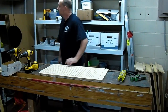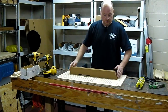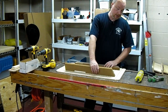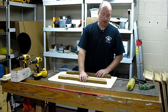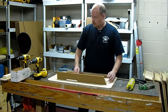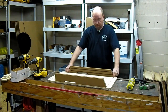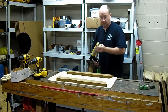We'll start by getting the three-chamber sides. These sides are milled out of a weatherproof exterior material that's used to make a lot of signage — you've probably seen it in the form of signs and not known it. It is exceptionally weatherproof; I've put some of it in a lake and left it for a month, came back and it was still in very good condition. I start by placing the sides and folding them in so I can see exactly where I need to put the adhesive sealant.